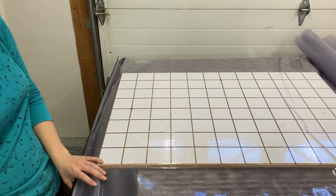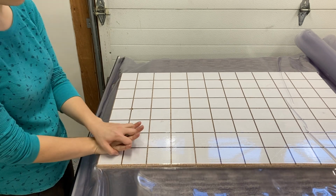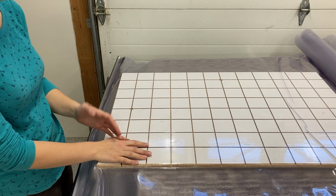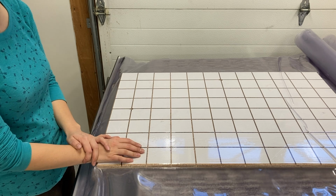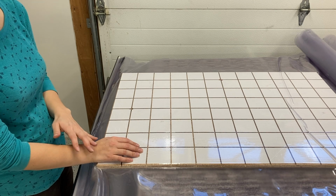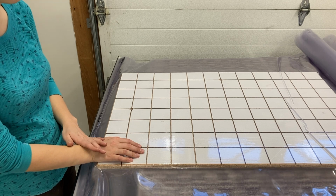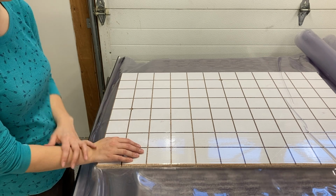And the pump has 2 cycles. It has auto cycle and continuous cycle. Typically, I would always recommend auto cycle. That just means every single time the pressure falls below a certain point, it will turn the pump back on again. If you run it at continuous cycle, the motor tends to overheat pretty quickly. So I've really only run things at continuous cycle if I have a significant hole in the bag that I can't repair on the fly, and an important glue up inside that bag. I'll just set up some fans to cool down the motor.